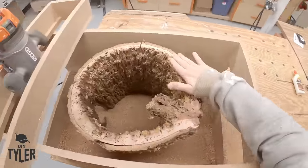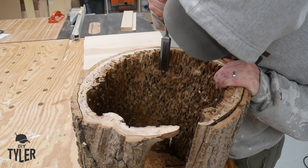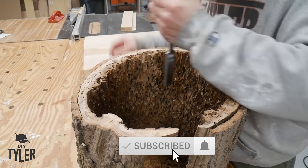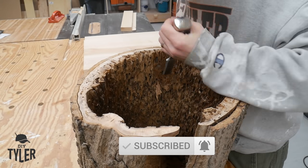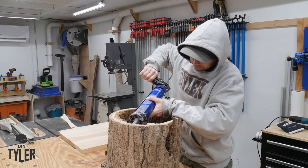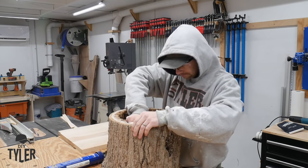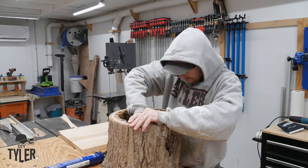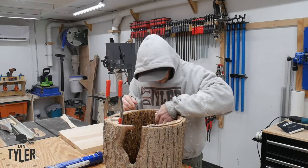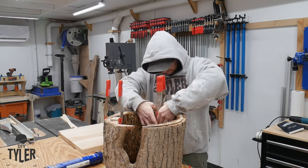The plan is to put a DIY cookie top on this stump as the stool seat, and we need something strong to fasten it to. I used a chisel to chip away a couple of portions on the stump to make it flat, then used construction adhesive to bond a chunk of hickory in place. I used construction adhesive because there are lots of big pores and gaps inside the stump — construction adhesive will fill the gap and allow a good bond, whereas wood glue wouldn't fill the gap and would likely fail over time.